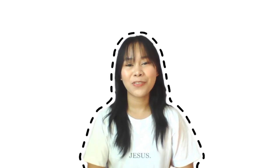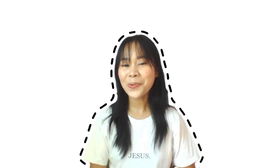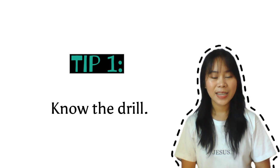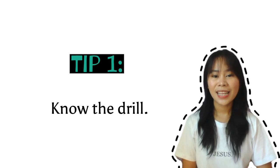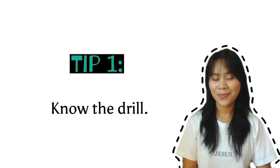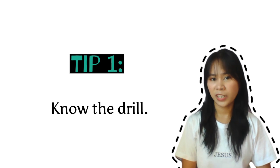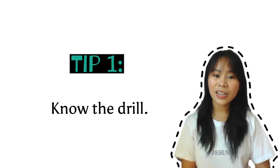Hello guys! It's me, Clarine. At this moment, we will talk about the tips for hand tapping the perfect hole. Threading a drilled hole may seem like a simple procedure, but plenty can go wrong if we don't take proper precautions with hand taps. Tip number 1: Know the drill. Store taps with their matching drill bits to ensure you use the right tap for a fastener. Holes that are too large can result in shallow threads that can strip or fail to engage the fastener. If holes are too small, it can bind the tap or cause chipping by forcing it to remove too much material. It is really important to use conversion charts and tap or drill charts to calculate the correct hole size.